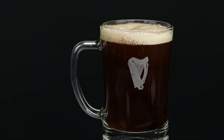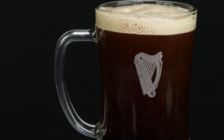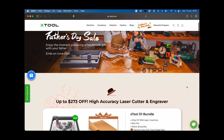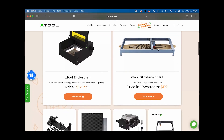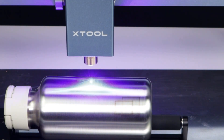We're also going to test the laser on stainless steel. Full disclosure: Xtool did send us this laser for free. They did not, however, have any requirements for what we should say in the video, nor did I get to see the video before anyone else. There is a link to the laser in the description — if you choose to use that link when you purchase the laser, we will get a small kickback. Right now there is a great sale for Father's Day. The laser is running at 100% power, 600mm per minute for one pass, and the color came out very nice and dark.